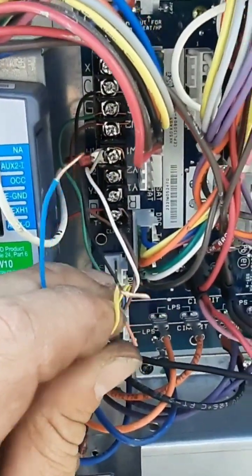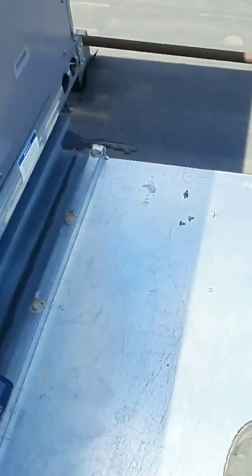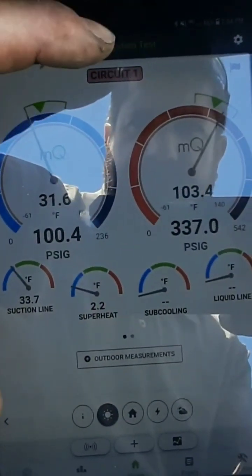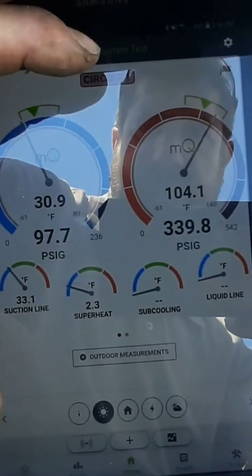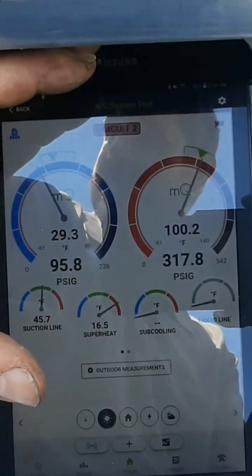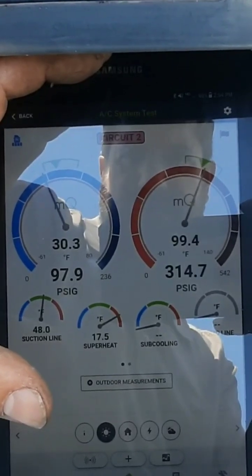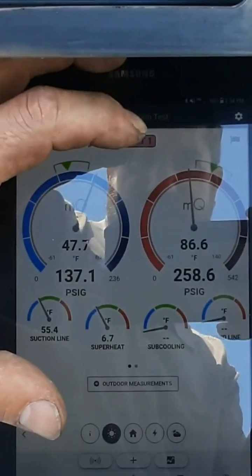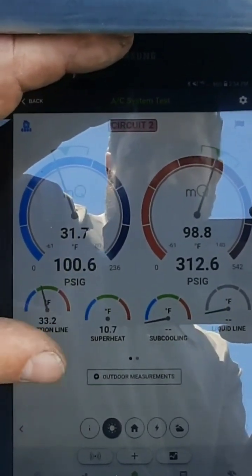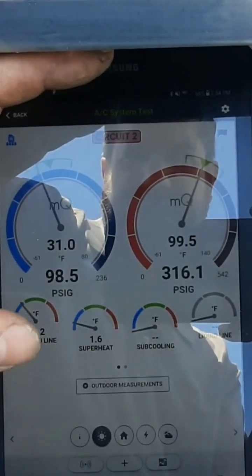I took my cooling call away and they're still running, so I've got a de-hum call — that should be straight de-hum mode. It's just weird, my valve stage 2 is still running. The expansion valve is working, so I didn't lose a bulb or anything like that.